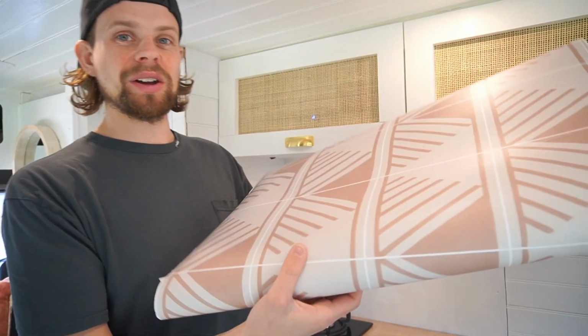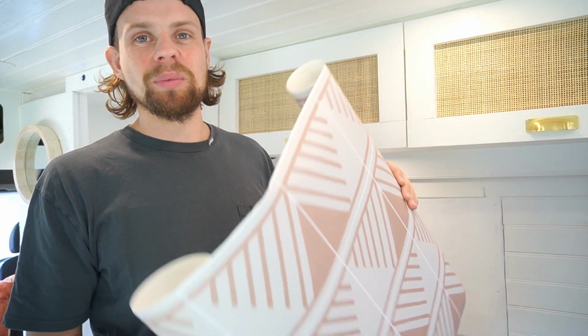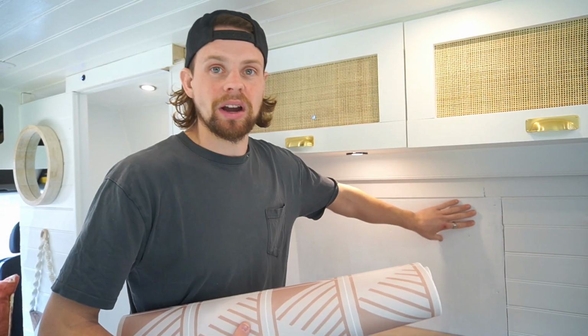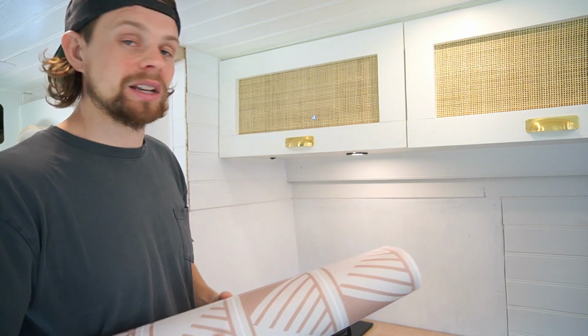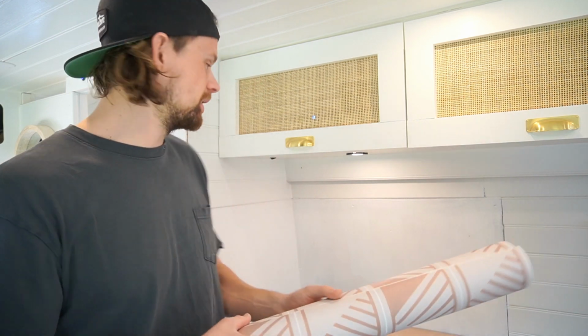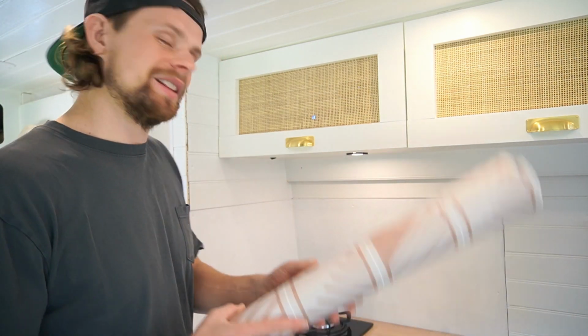Tiles have arrived, they look amazing. And we just want to ensure that we're getting a nice strong bond on the surface. The first thing that we've had to do is paint our plywood lining. You want to use a nice high gloss paint, because that's what will provide the nice strong bond. They're removable, so you can peel them on and off, but if you don't have a surface that is high gloss, they'll start to peel in the corner and they won't last as long. Provided you've got a glossy surface, then you're good to go.